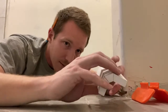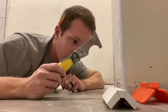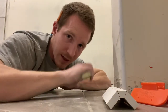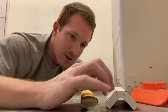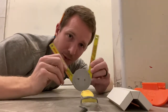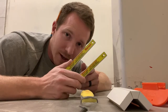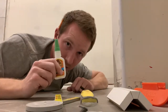You're going to need a jig of some kind, whether you make it or buy it — I recommend buying it. You're also going to need a 5-in-1 tool, which is for cleaning up corners so there's no crud that would mess up your miters. And this is a protractor — you're going to want one of these. It's going to tell you exactly what angle you need to be cutting your miters at. You'll also need super glue and an accelerant to make it dry faster.